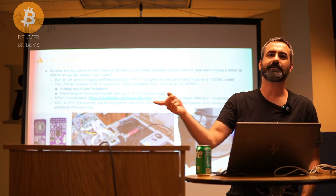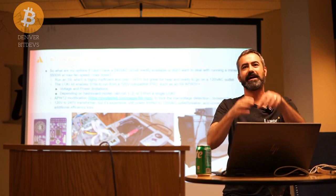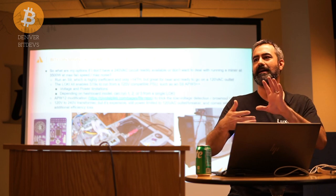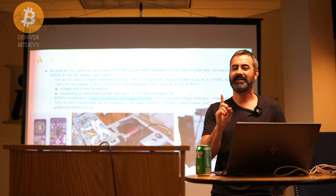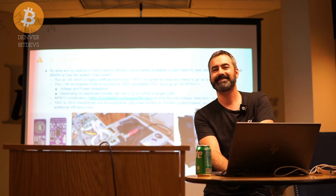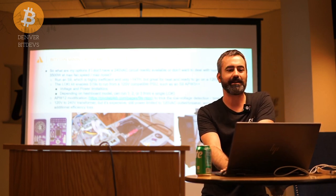And if I take the cover off, I always power it off first, because when you take that little metal cap off, there's a chance you could touch this and that everything's grounded on the chassis. So definitely a chance of shorting stuff out and seeing sparks. I've actually seen it happen once in my garage, and that will be the last time. So great question, though. Safety is a big thing with home mining.